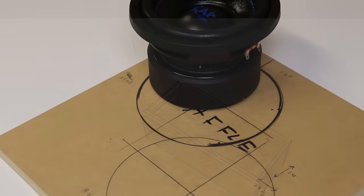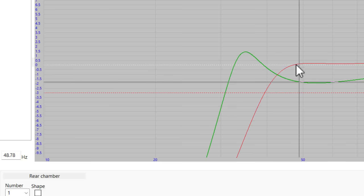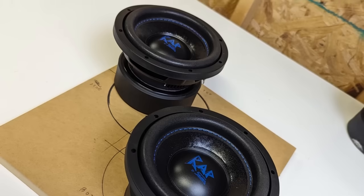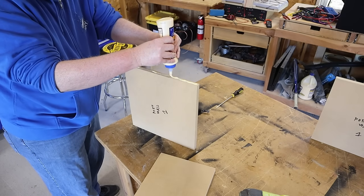This more traditional design — a single subwoofer in a quarter cubic foot box tuned to 45 Hz — requires a 53-inch long vent, which is completely absurd. Plus, it can't dig down and hit the lows; it loses all its steam under 40 Hz. But if we go with two of these little subwoofers and plug in Savard's recommended specifications, you get something quite different. Savard's recommended enclosure with two subwoofers and a lower tuning frequency of 35 Hz can work with a 30-inch port — still a challenge, but much better than the alternative, and you get your low-end extension back.